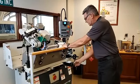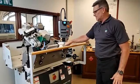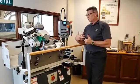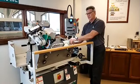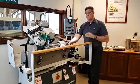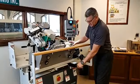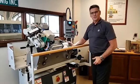If I want to do a straight knife, I simply turn that halfway and it locks this in to where all I have is a side-to-side motion. Okay, so what the operator does is he just simply stands on the end of the machine, keeps the knife rolled over, and lets the bearings of the machine itself create our straight knife. So it's a much, much more accurate tool over a longer period of time. When we're finished with our straight knife grind, we just simply go quarter turn or half turn, and we have freed up the full movement of the machine again.